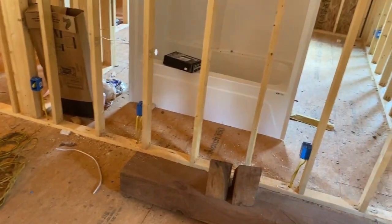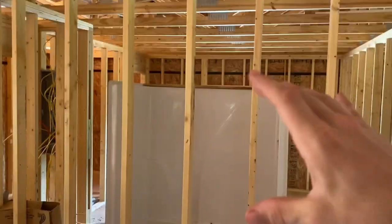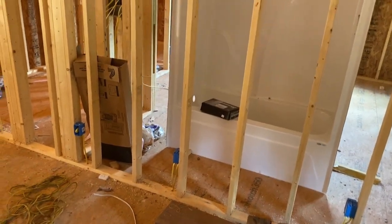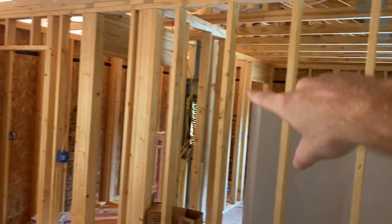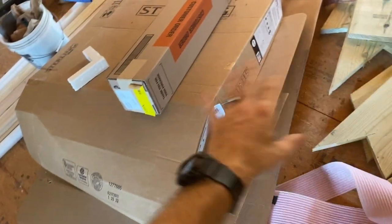We already got it ran, and we have to frame out a spot. We have to get the firebox for the gas fireplace, frame out the place for the box, and then do a hearth and all that stuff when we do the insert. And we're gonna put a plug on the wall for a TV there above the mantle. So we're probably gonna have to jump to one of them too. Although we may end up coming out of the top of the box, doing that plug, and then one here, because I'm gonna have one in the floor, which will be last.